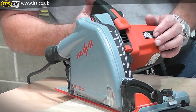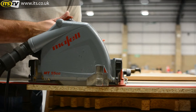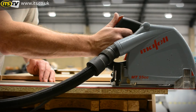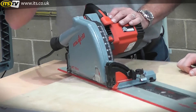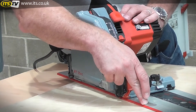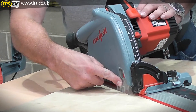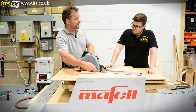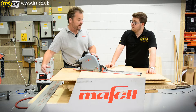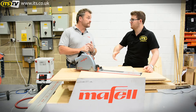We've gone for an enclosed housing for better dust extraction. If you open that up you've even got a rubber seal gasket to stop any dust escaping. The only place where sawdust can escape is the gap created by the rail, so by simply pushing down this retractable guard that gap is closed — the sawdust is fired into the housing and you're now extracting from the back.